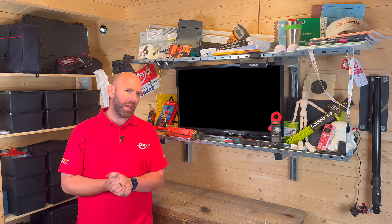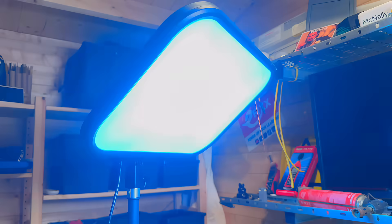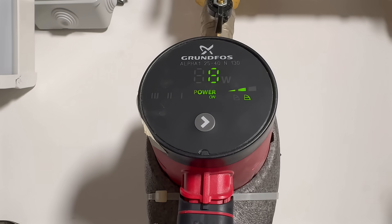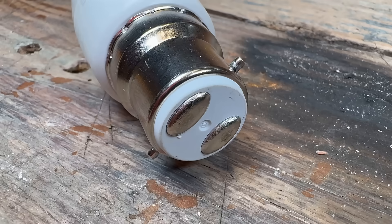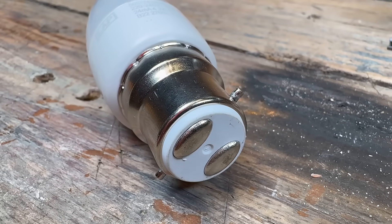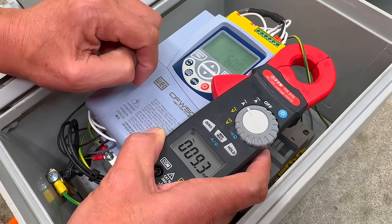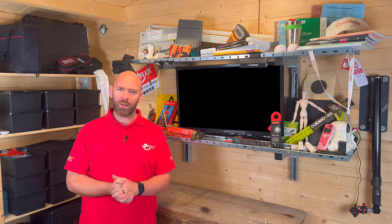A lot of it is produced by power electronics — think solar inverters, washing machines, or LED lighting. But here's the catch: just because it's a machine with electronics doesn't guarantee it'll produce DC leakage. Not all LED lighting will leak. An LED lamp, for example, has no connection to earth, so it simply can't.